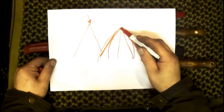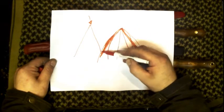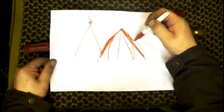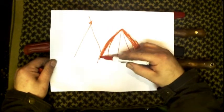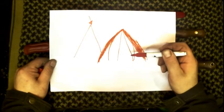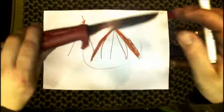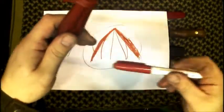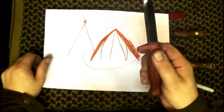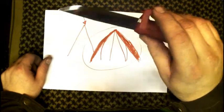So for me, trying to make a crude convex edge — if the Scandi was inside it — a convex would come up like this. Not quite as sharp at the very edge, but all this extra steel just makes the very tip stronger. We're talking right at the tip, right where that ink would be — so it's a high-performance edge.